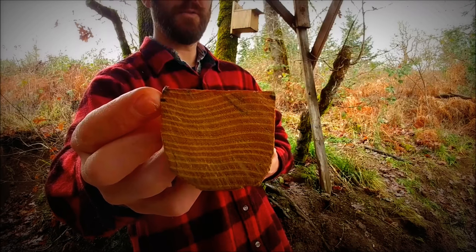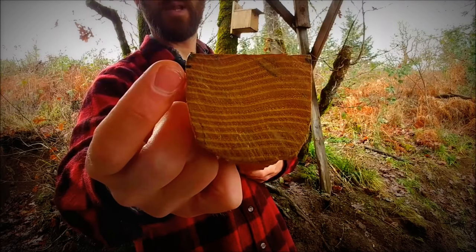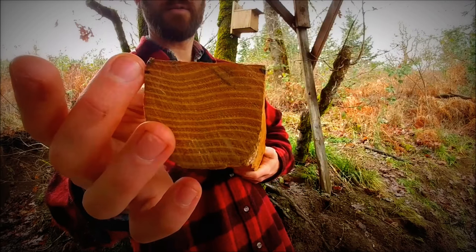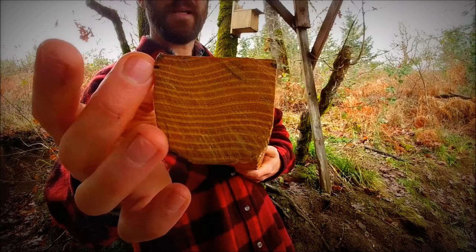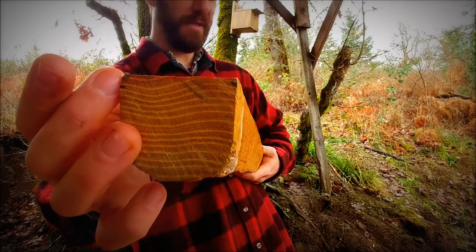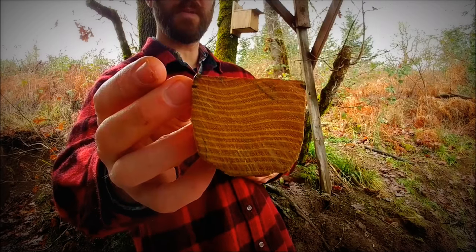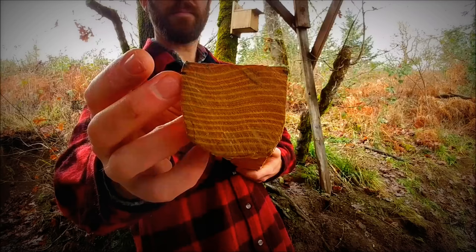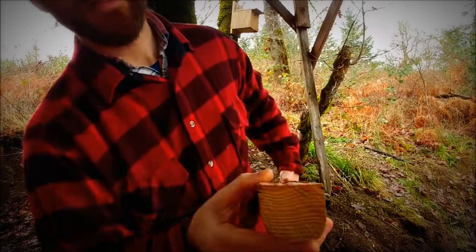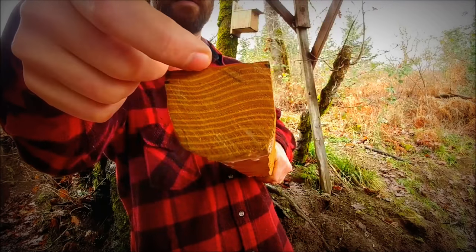It makes it pretty easy to create a flawless back on the Osage. I made a little black mark on either end of one particular ring — that's the ring I've chosen to be the backing for my bow. So I'm going to tear off everything above that. There's not much above that so it won't be a lot of work. This stave is going to be good for this demonstration because it shows a few particular challenges you might run into when chasing the ring, and right here the rings kind of dip down.